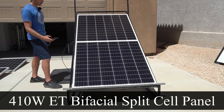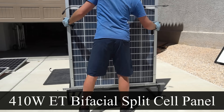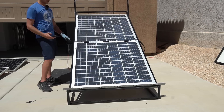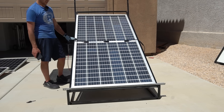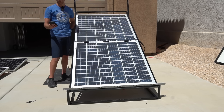Let's flip this panel over and see how much we collect on the back side — 270 watts, and going up to 279 watts. So yes, the bifacial panel does work by collecting energy in the back. But these are ideal for cold climates. Cell temperature was as high as the used panels. They do have a good warranty so degradation isn't a big worry, but I was expecting at least 100% STC output. We almost did but had to spray water on it.